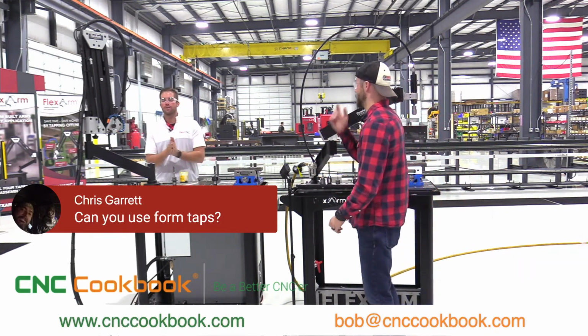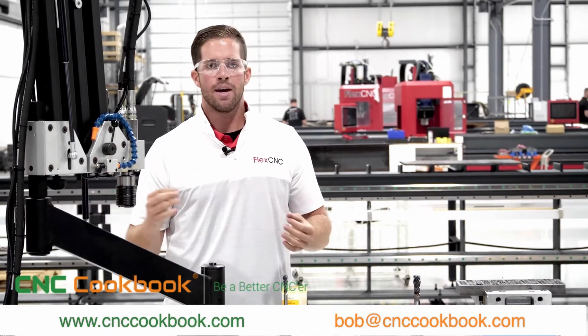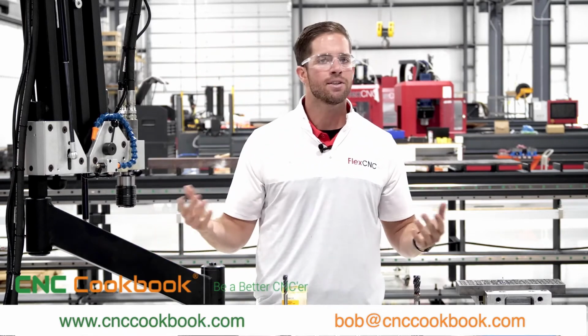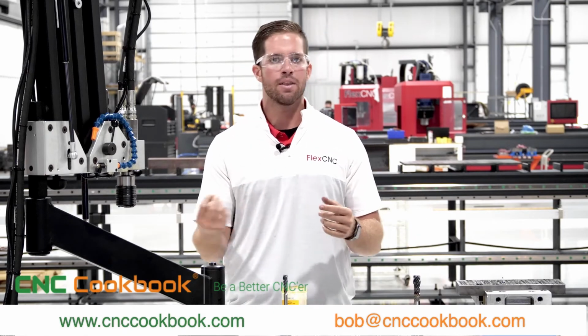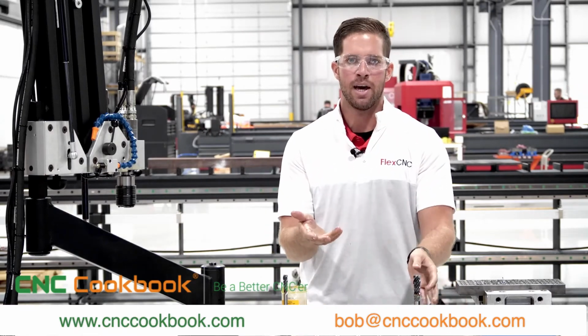Chris, thanks for the question. So to answer, yes, we can use form taps. At the end of the day, it honestly comes down to the end user's preference on whether or not they want to use a form tap or a cutting tap. I typically like to use the form tap, and the reason being is that it's cleaner. It displaces the threads rather than cuts it. So at the end of the day, you get less mess and chips and things like that.